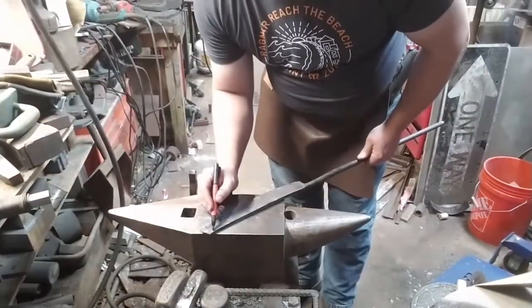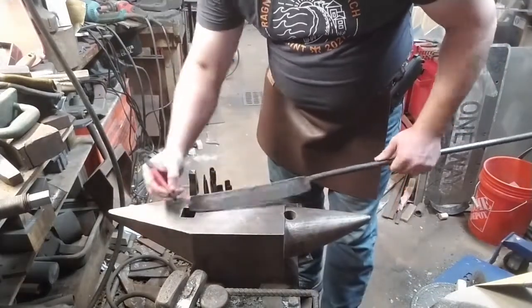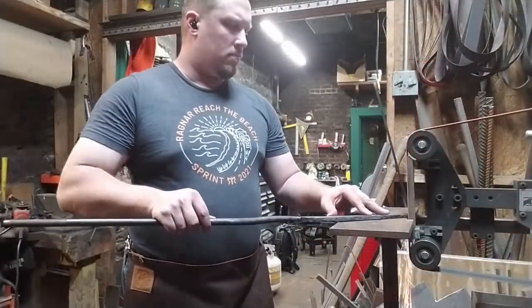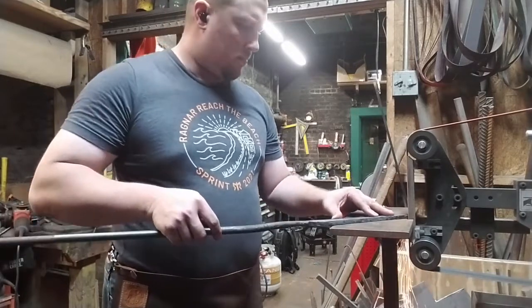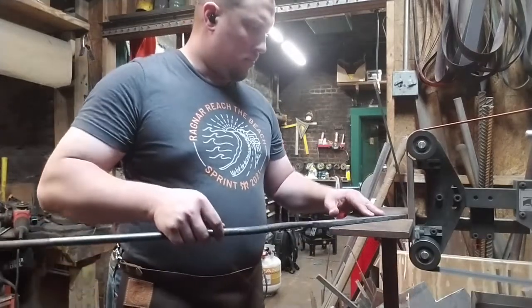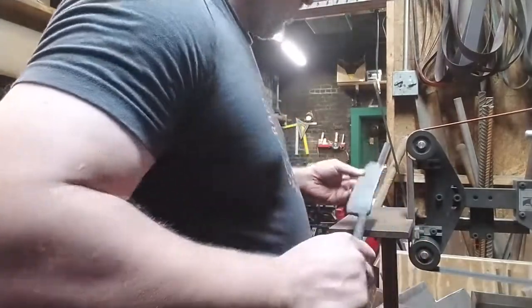Of course, you can do that hot. You can use a hot cut, and that was done in period. However, depending on how you build the shape of your hot cut, you can wind up with a lot of pattern distortion. It can be actually very ugly on the end of your knife. The way to prevent that is to have a hot cut that is only beveled on one side, and I've actually worked with building one of those, but it's not done yet, so I'm not going to do that process hot. But you can.